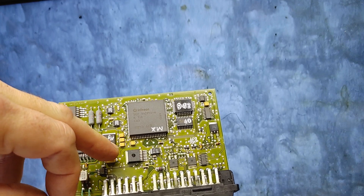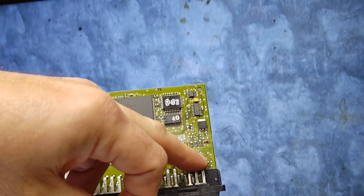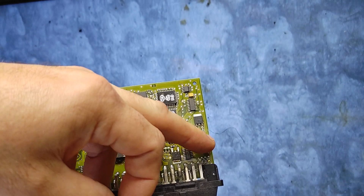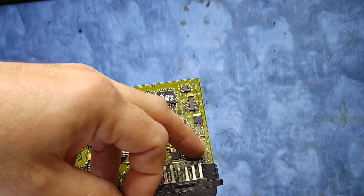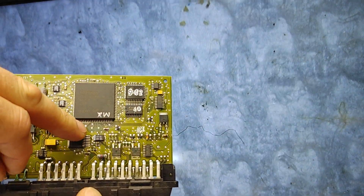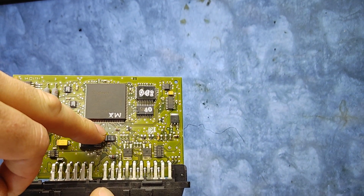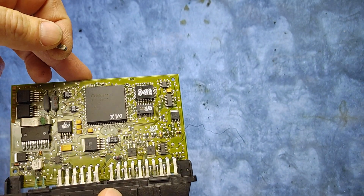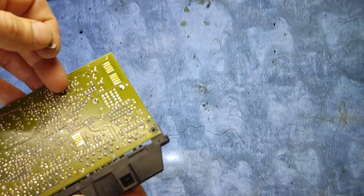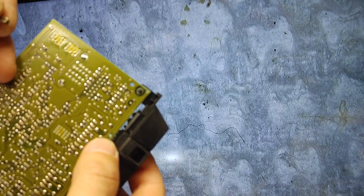You can imagine how much rust damage was all around, but I cleaned it all up — cleaned all the chips. A capacitor that was here was completely rotted out and not even secured to the board — I already threw it away. I sourced the capacitor from this module and the crystal from that one, because this one didn't read, likely because of the water damage in that area.